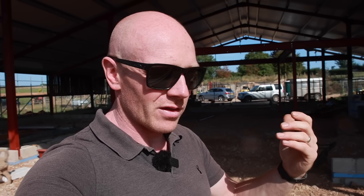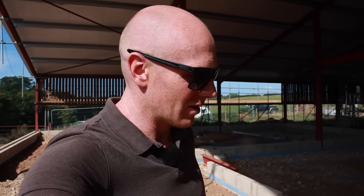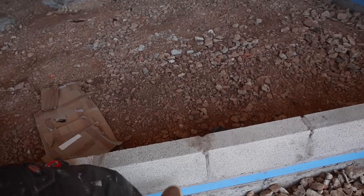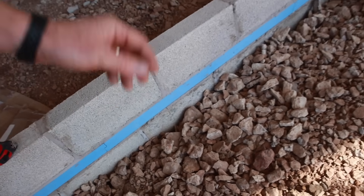What is interesting is the bond you get between the cement fibre board and the mortar and the block above or below — it's so strong. You'd think they would just snap off or peel off like a DPC might, but actually the bond is very very good. This is just a single block, but it'll be completely retained because we've got a slab either side of it. There is no weak spot — you haven't got a weak patch anywhere in the build. Really impressed with how that worked.